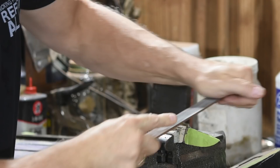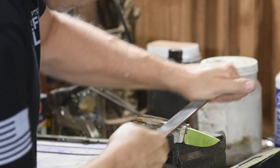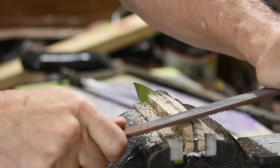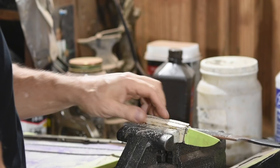Don't use too much alcohol though or it'll wick under the scales and suck all that epoxy out, and that's no good either. After letting it cure for about 24 hours, I'll finish up the handle. I'm using a rasp in combination with a file. I'm aiming the teeth of the rasp towards the spine, not down toward the face of the scale. It's easy to tear out big ol' chunks of wood if you go in the opposite direction. If you want to avoid flipping the knife in the vise, just turn the rasp around and work it backwards.